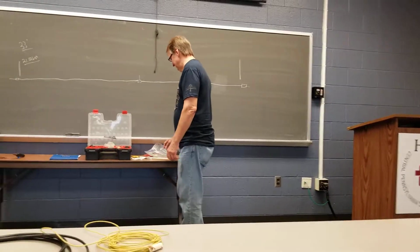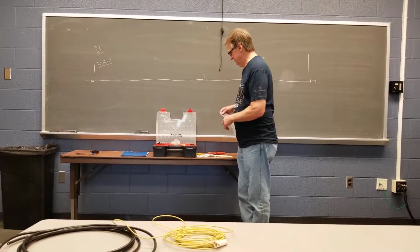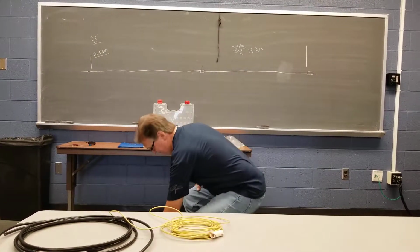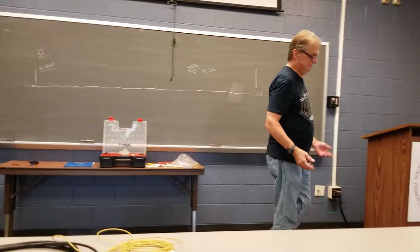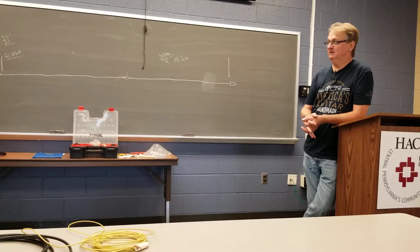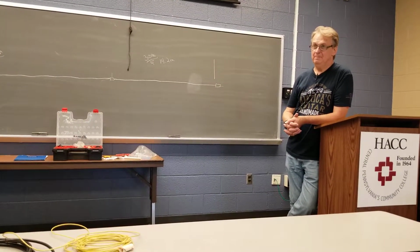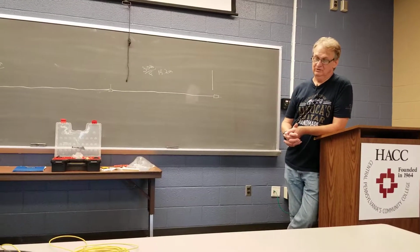I don't like tuners. So why couldn't you just put a quarter wave of 75 ohm coax at the feed point and use 50 ohm for the rest of your feed line? You could, but what's the point? It's only a slight mismatch. But you could. Of course, that changes as you change frequency, but it's close enough.